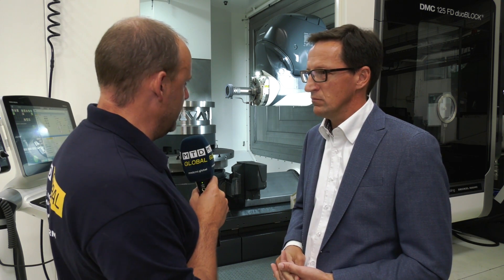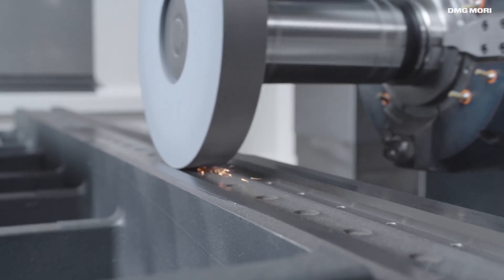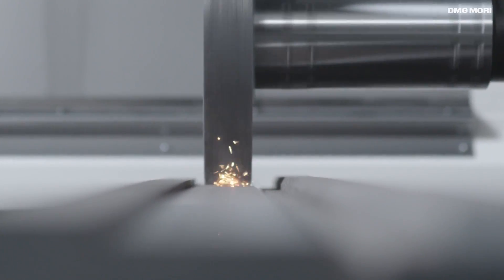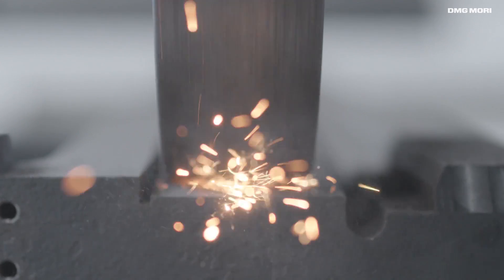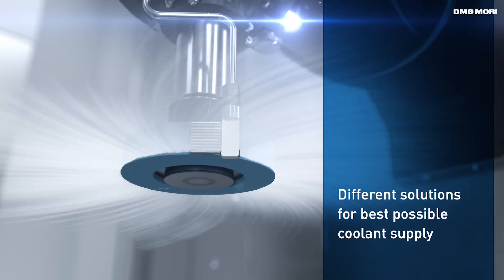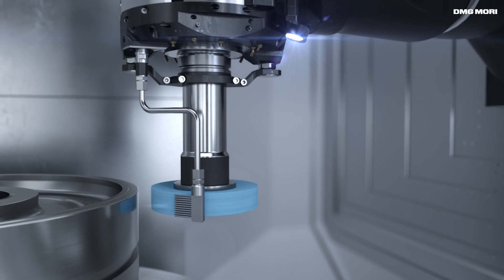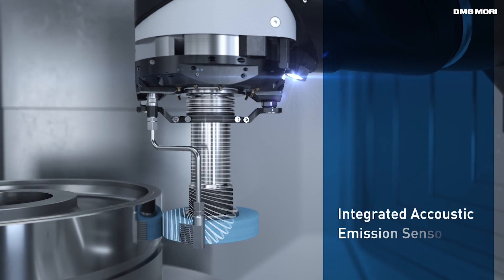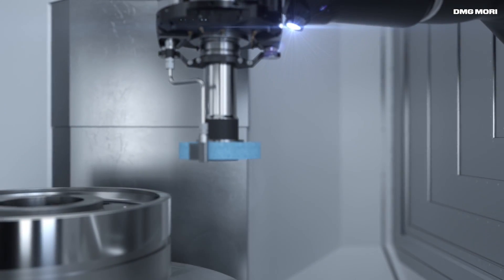To conclude on the types of grinding you can do here — surface grinding with the head in the horizontal position, cylindrical grinding, and we can also do the grinding of profiles, which is something we are working on at the moment. Outer and inner diameters can be ground. We also have this adaptation you can see here behind me on the tools, which brings the coolant directly to the grinding wheel for best surface performance during the grinding operation.